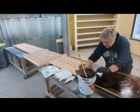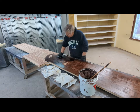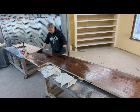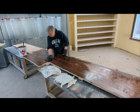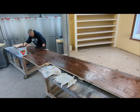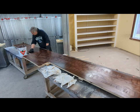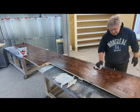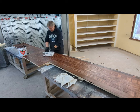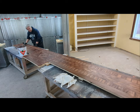Same process — I'm taking the stain and wiping it in, trying to fill the pores and any little crevices as much as I can. I'm not relying on grain filler only because I didn't want anything that would destroy the mahogany color. There was one UV-coated filler that looked decent — it could also act as a sealer and save a lot of work building up coats — but I could only buy it by the quart in Canada. Maybe next time it's available I'll give it a try.